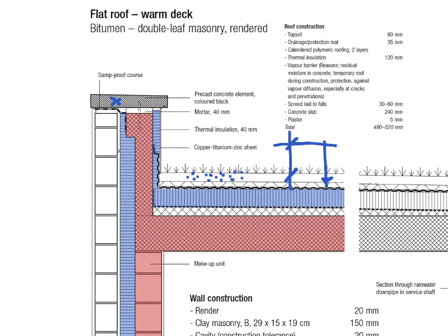With the insulation layer in this particular case, you can see there's actually a tiny little gap up here — the insulation is not really continuous. But that's not too big of an issue. If you think about heat flux, with outside temperature up here and inside temperature down here, the pathway of that temperature fall is actually really far away, and with protection all around it should be enough. But ideally, especially if you have a metal sheet or timber construction protecting your ledge, it would be beneficial to have a little strip of insulation in here as well.